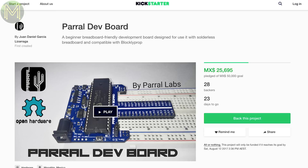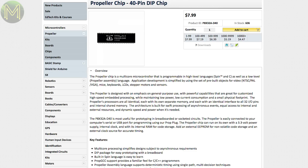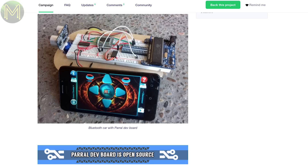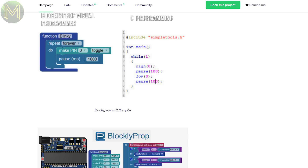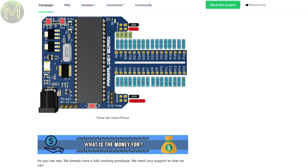Here's another breadboard add-on. This one contains a P8X32A chip and a 3.3 or 5V mini power supply. This chip comes from Parallax Incorporated and is a 32-bit MCU with some fancy stuff on it, like video interfaces, sensor integration, signal processing, and things like enhanced assembly language that gives you conditional execution for individual instructions, allowing jitter-free signal generation.